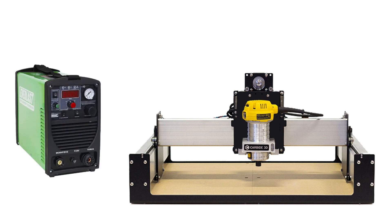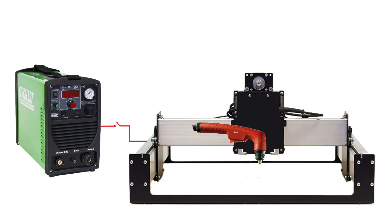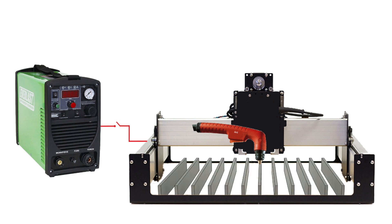For now let's talk about the bare minimum we need to accomplish to make this thing function as a plasma cutter. First, we need to get an appropriate plasma machine. Then we need to remove the router and replace it with our torch, which we have to find some way to strap to the z-axis. Next we need a mechanism for our Shapeoko control board to turn the plasma machine on and off. Finally, we need to remove the spoil board and replace it with a surface more appropriate for cutting metal. There are other features we could add — things like a water bath or a live torch height controller — but we're doing the quick and dirty version for now, with the idea that this is really just a learning experience.